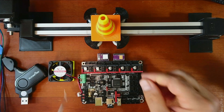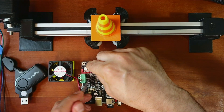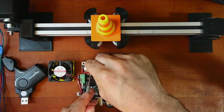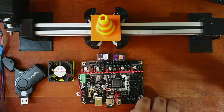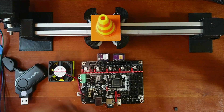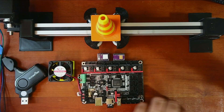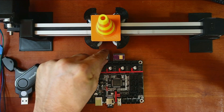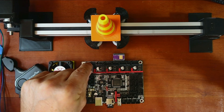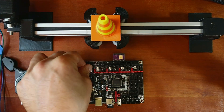I'm going to pick out the actual jumpers so we can set this up. We have to take all of them out, then place them back in the right position. As you can see, compared to the other ones, they're shifted over now. These can be a little hard to get into place — you may have to wiggle them. Now we know where the enable pin is, so we're going to line it up and slide the driver in with a little bit of pressure.